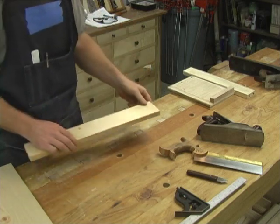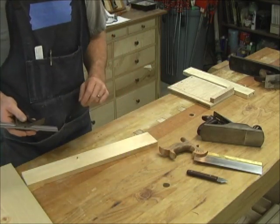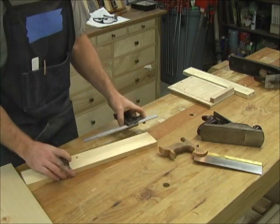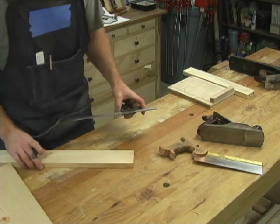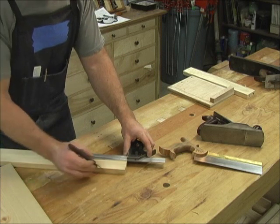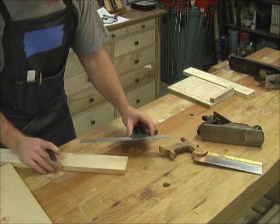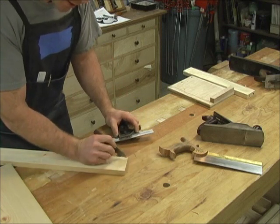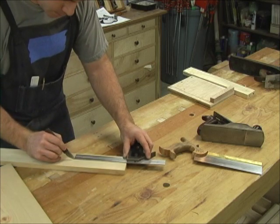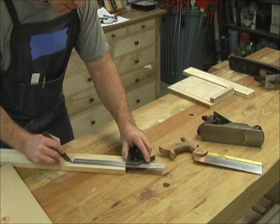or the stop. Essentially what this is is a wedge, and the taper of the wedge is about 1:7. Now the exact dimensions are not critical at all, just make it such that it will wedge. So I'm going to do a 1:7, and I'm going to start it off at about 1.25 inches. And what I'd like to do is get 2 wedges out of this length. So here's my 1.25 inches from this corner to here, and then I'm going to measure out 7 inches with a rise of 1, and that's about the width of the gauge.